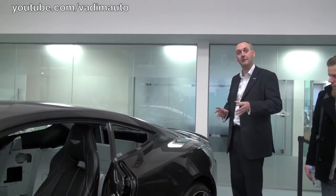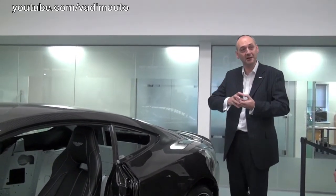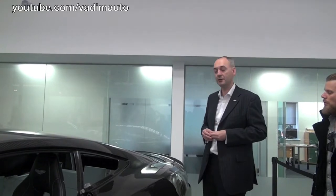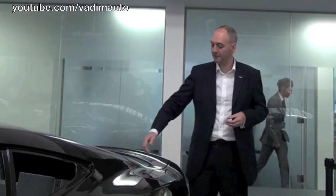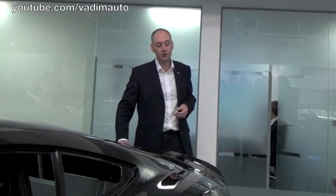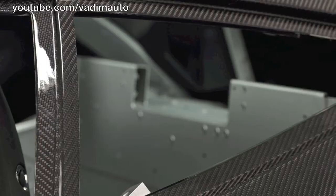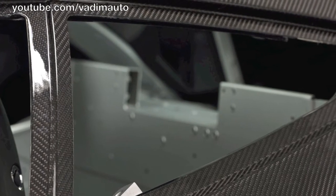At the rear of the car I'd like to talk in a little more detail about how design and engineering come together — that's where the best automotive technology comes from. It's where engineering complements the design aspiration. At the rear of the car we have this integrated aerodynamic device which you could not make out of metal. Whilst the carbon fiber saves us about six kilos of mass, one of the great things about using carbon fiber is you can create shapes and forms that you can't create out of aluminium or steel.